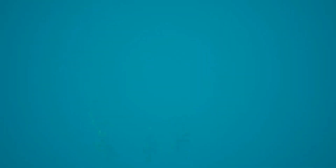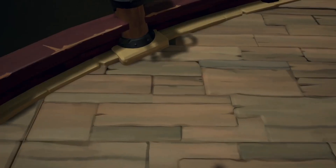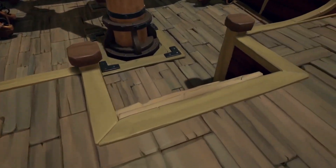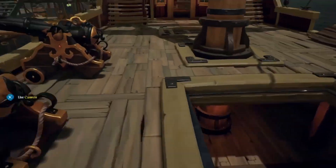After you're sure everything looks good down there, let's move up and take a look at the deck. The deck of your boat is a whole other animal. Unlike your hull, it sits above the waterline and it's exposed to oxygen. Decks take a lot of abuse from the sun and the rain, and they require special care. As you can see, cracks in the wood joinery on deck are prone to trapping water and rotting. Any spaces between wood joints need to be glued again, or at least tarred.